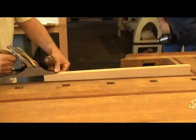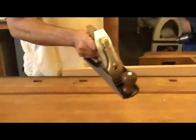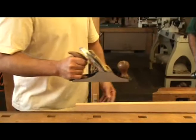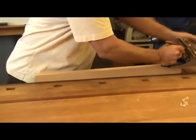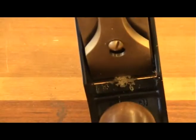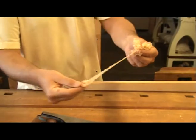When the iron begins to make contact, place the extreme left or right of the plane sole on the scrap wood and make another pass. In my case, you can see that the right side of the iron is making contact with the wood and creating a shaving. I then make a pass with the left side of the sole — it did not make contact, so this tells me my blade is low on the right side. I make lateral adjustments until I get a uniform shaving on both sides of the iron as well as in the middle. This tells me my blade is square to the sole. Ideally, you want your shavings to be uniform thickness and full width.